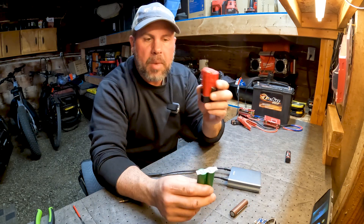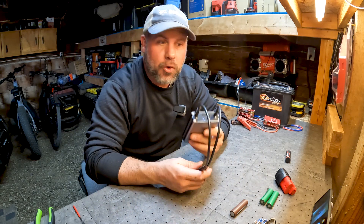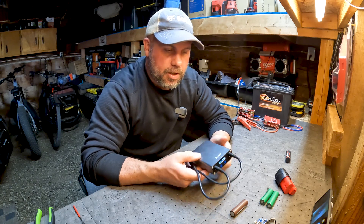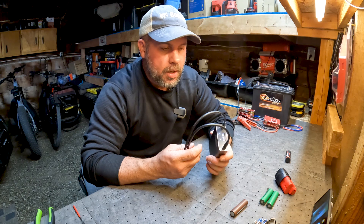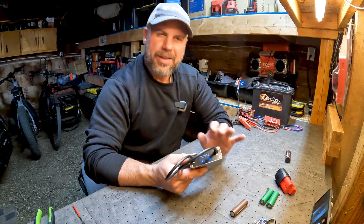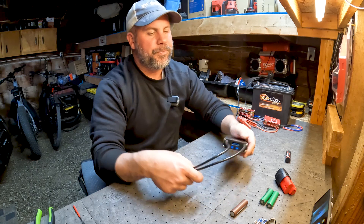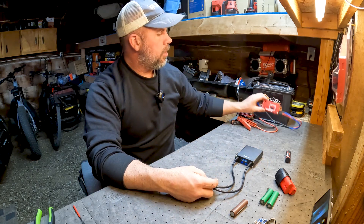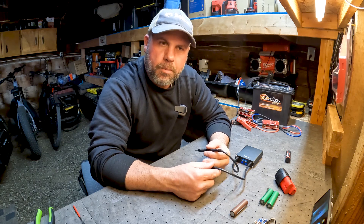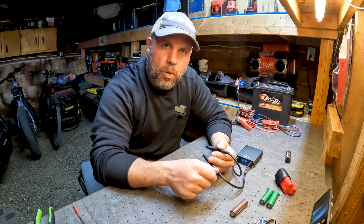For the hobbyist that just likes to repair batteries, make small battery packs, or just tinker around like me, this is an incredible little welder for the price. I'll leave a link below in the description where you can get it on Amazon — they've got a gray version and a black version. There might be just a little inconsistency in the weld, but nothing I can't work with. If you've never used one, like we talked about in the other video, it's a feel thing — press too hard and you're lowering the resistance, and you won't get a good weld. Don't press hard enough and you'll blow a hole through your strip.